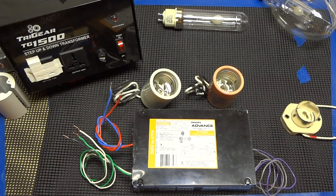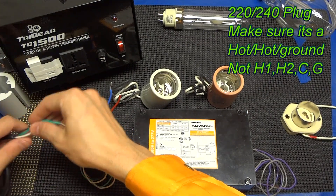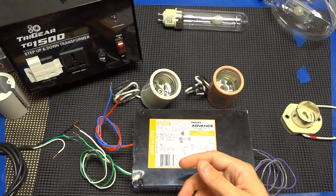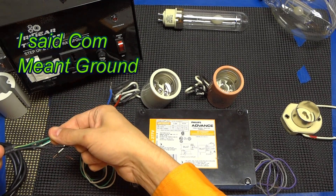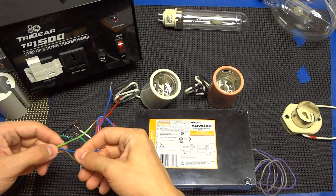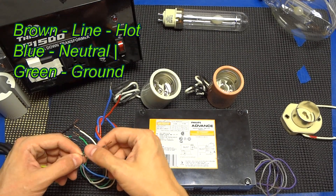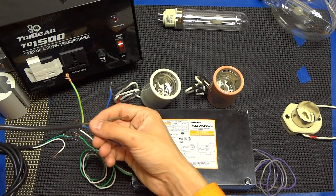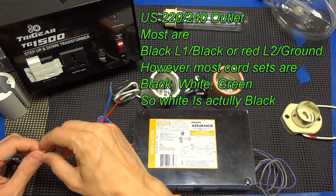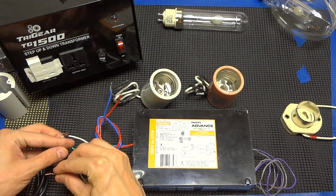If you're not going to hardwire it and you have a 220 outlet and a 220 plug, depending on what style plug you have, your cable may have two black wires or a white and black wire. This example is meant for a 220 outlet — it has two blacks and a green for ground. You can also have a cable with blue, brown, and green, which is typically EU standard. Here in the US, you would just take black to black, white to white, and green to green.